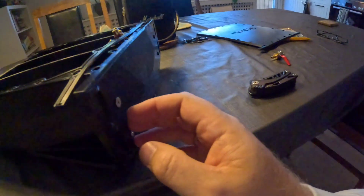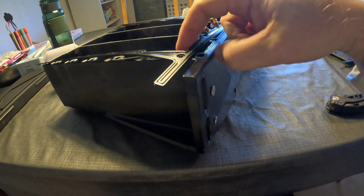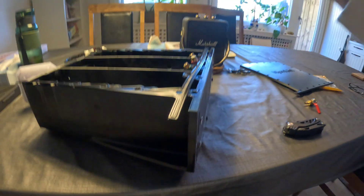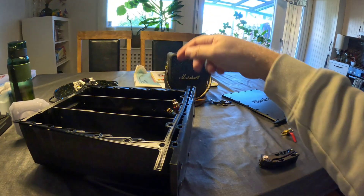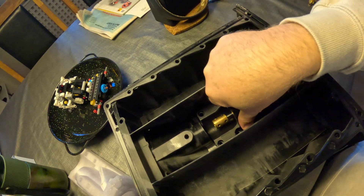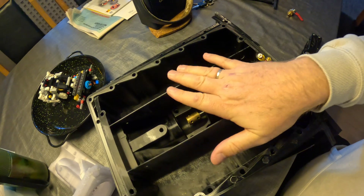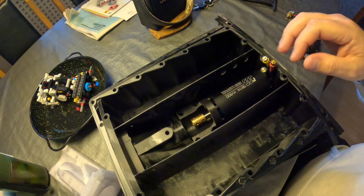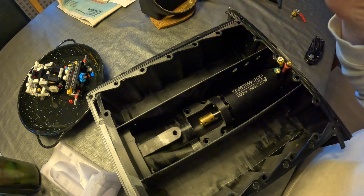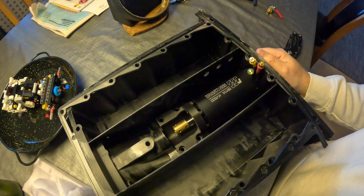There are a few things I learned here. I printed this in two pieces — you can see how I used screws, but yeah, first prototype. I want to make it wider and have a water intake against the flow to push water up to cool the motor controller, and then just let it flow out. That means the only thing underwater will be the motor. You might think you can't have that underwater, but actually BLDC motors work really well with water. The motor controller or the servo would be trashed if they got wet, but the motor wouldn't — even with a leakage it would run fine, and you could probably dry it out.